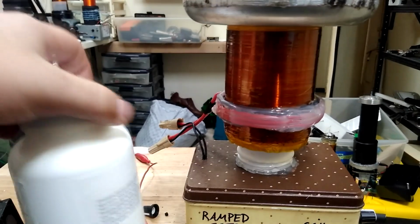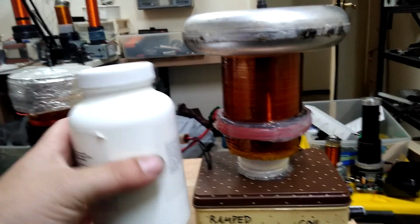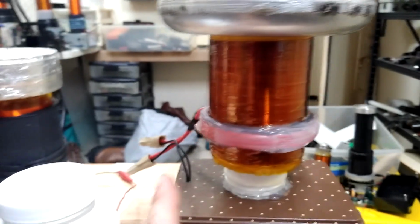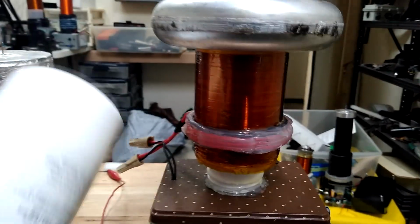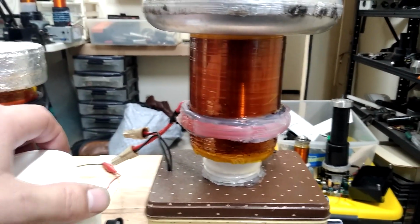These are like dog pills. I don't know where you get something like this, but I'm sure there's lots of bottles available out there of the same dimensions. I was able to use it a little bit, but the voltage was too extreme on the full bridge and it started arcing over with the dimensions of this primary. So obviously the next one I wind, the secondary will be identical, but I'll try to accommodate that primary a little wider, and try to insulate it a whole lot better.